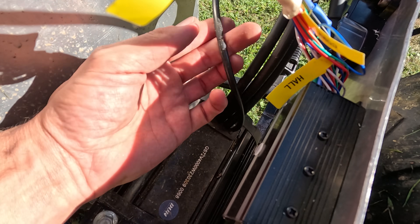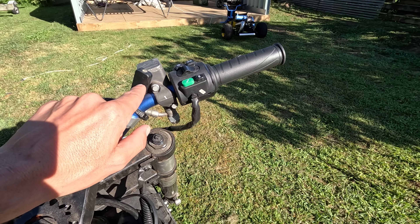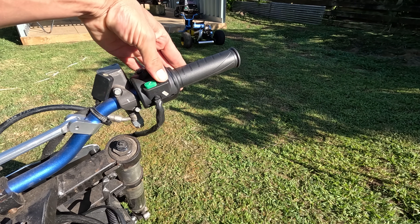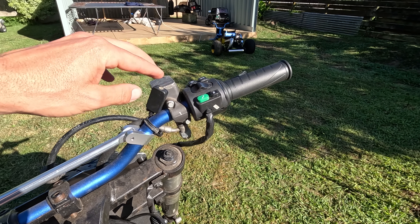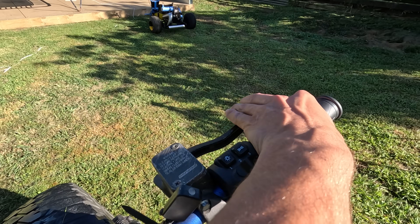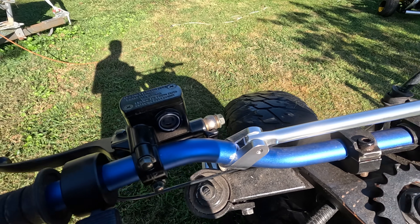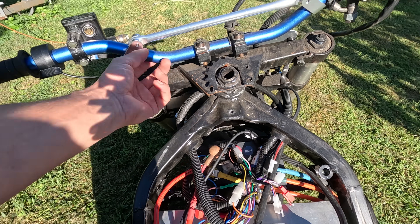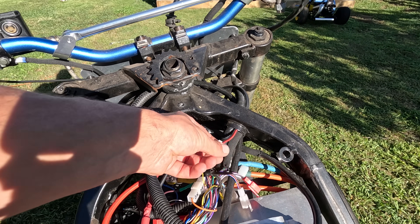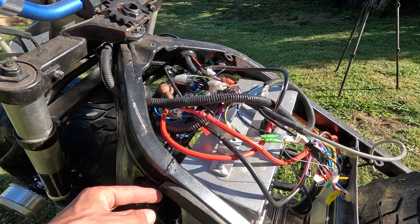Some wires go to the hall effects sensor — that's the hall effects wire going down to the sensor in the back, which tells the coils when to fire. There's a USB dongle, a hand throttle with three speeds, and reverse if you hold it and press out. High speed does wheelstands. There's a conventional disc brake up front and a left-hand rear brake with a switch I've wired in so I can hook up electronic braking — though I've got it disconnected now because it was interfering with wheelstands. This key switches on the Fardriver controller.